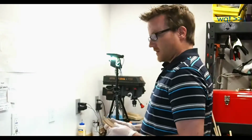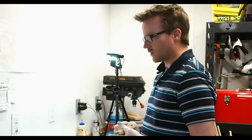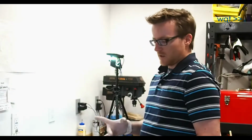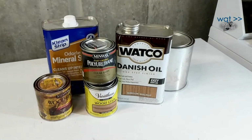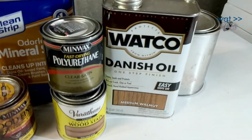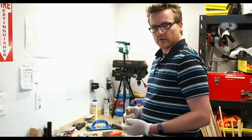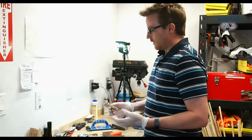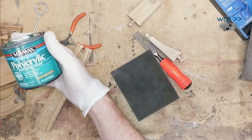Normally for woodworking projects, I like to use polyurethane, or you could think of something like maybe tung oil or things like that, but there's a problem. This is a children's toy. So if I start using petrochemical-based sealers or finishes, what kind of residue is it going to leave in there? And in particular, if a young child starts chewing on this or whatever, what are they going to get exposed to? So my solution to try and reduce the risk is polyacrylic.